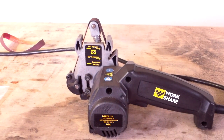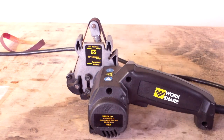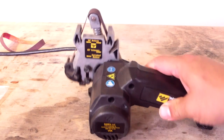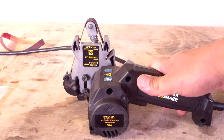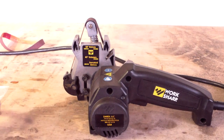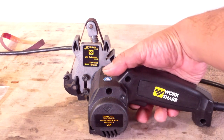Alright, so this is the first time I'm actually using this, so you get to have the newcomer's point of view on this thing. We've got a 50-degree knife, which in this manual says that is for outdoor knives. Okay, so in the description it says to hold it straight up and down like this and pull through. And it's supposed to be for the red, which is what's on there. That's the 220 sandpaper. You're supposed to do that 10 times. And then you're going to do that on both sides. And then purple. We'll put purple on, which is the very fine 6000, I think. Yes, the 6000 grit to finish it off. This also comes with what I believe is 80 grits. Yeah, 80 grits for grinding. We'll show that too. But let's go ahead and turn this sucker on and see how it do.